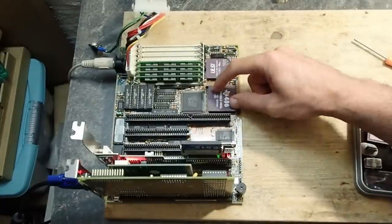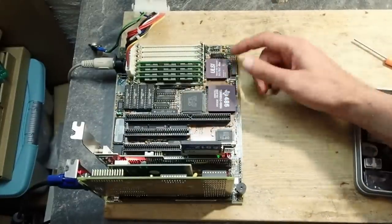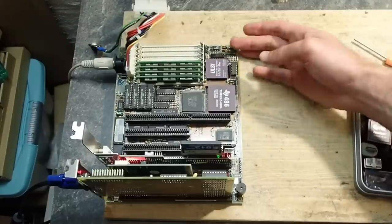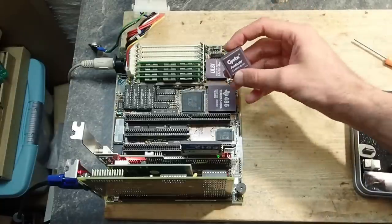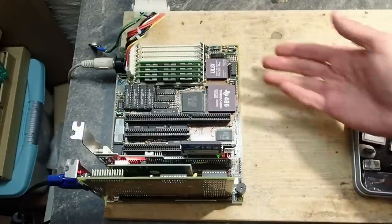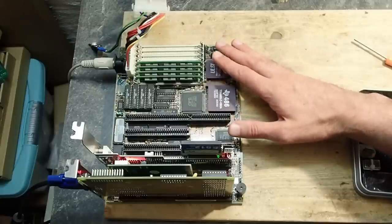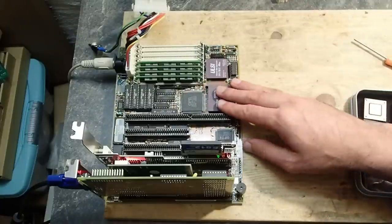It is a really nice board. I love its compact size. Really cute. In the future, I could play with BIOS settings to get some more performance out of it. The ULSI FPU is good, but not the fastest. I could replace it, for example, with the Cyrix FastMath. If you are interested in seeing the benchmarks of various 386 coprocessors, watch the channel of Atheotis. He made a great comparison. Also, CPU Galaxy made a lot of great videos about such things.